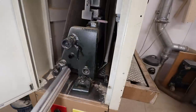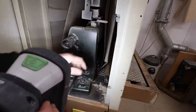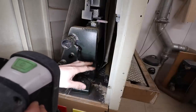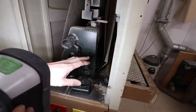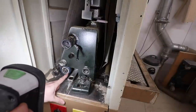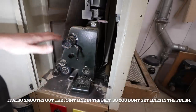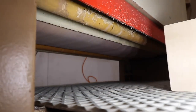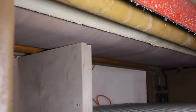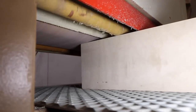What the pad is doing is spreading the pressure to get a finer finish from the belt. A wheel point-loads the belt — if there's any slight movement or wobble as it feeds in, you get a wobble in your finish. Whereas if you introduce some pad pressure onto the abrasive belt, it's traveling over about 30mm of width and that pad smooths out everything happening within the machine. You get a much finer finish on the actual material.